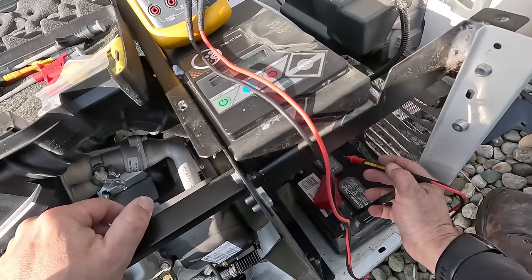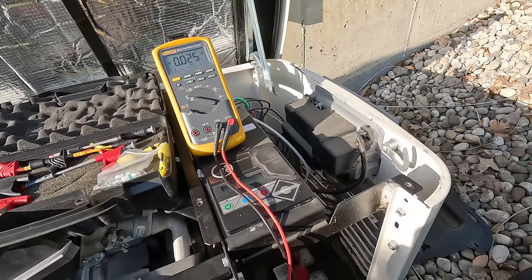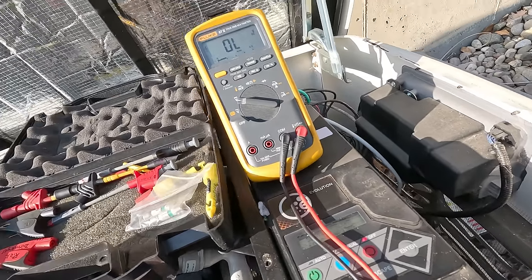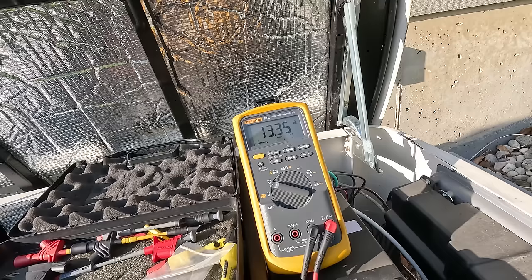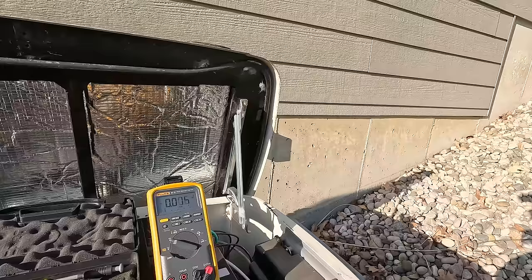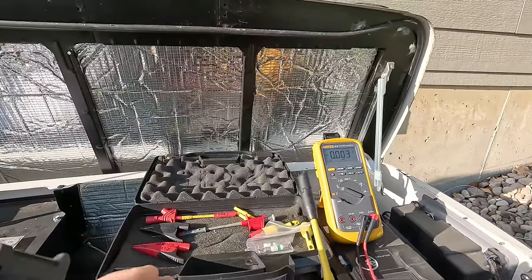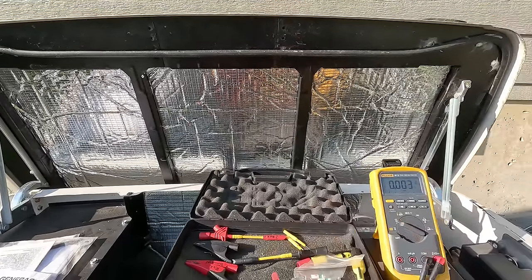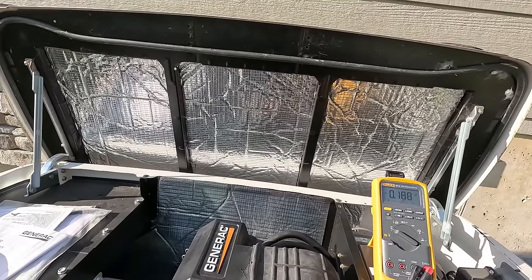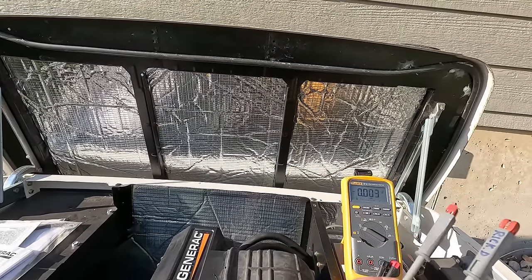See what happens to the voltage when we crank it over. We're going to put probe on battery post to battery post. We have 13.6 — correct polarity. 13.56. Let's kick manual and never drop the voltage. So potentially the battery is fine. Let's get down to the start solenoid and see if we're getting 12 volts down to that. Once the obvious things are eliminated, then I go on to the book. You should be able to figure out most basic stuff like batteries without a book.